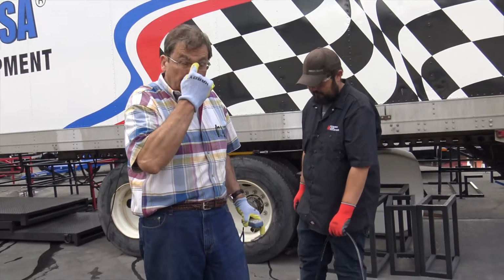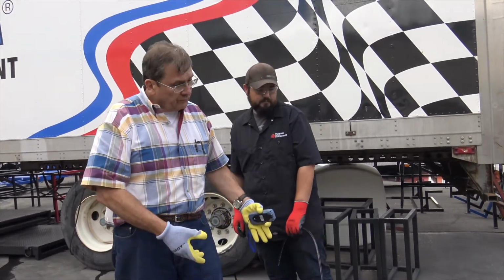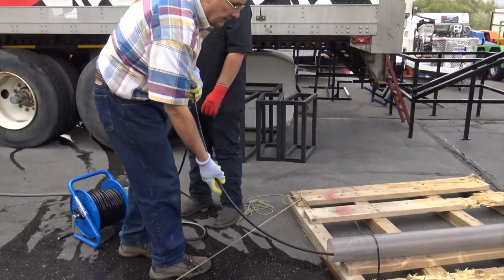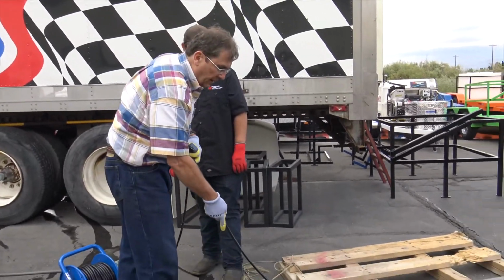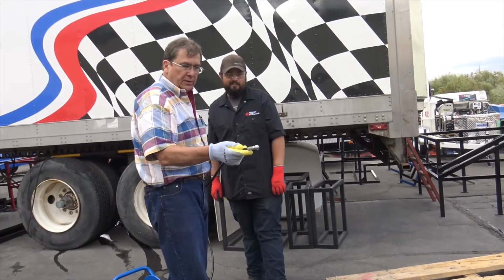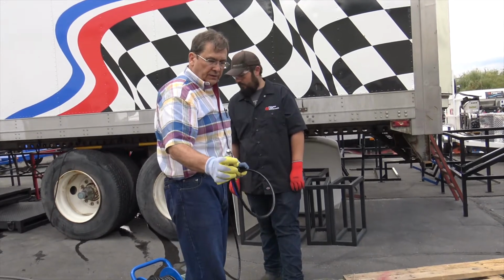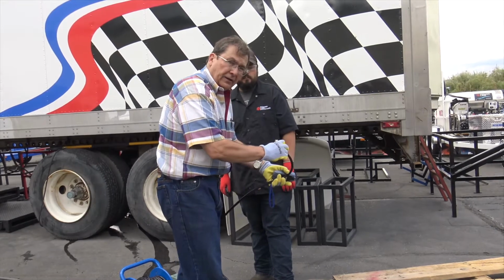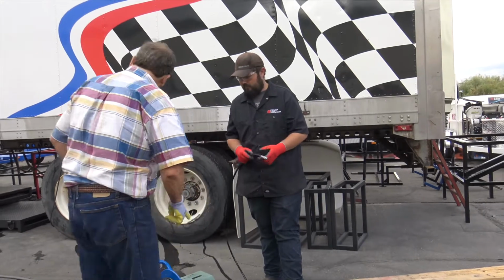Now if you have any problems with this hose or uncomfortable, don't use it. Just saying it flat out. Buy a little electric jetter from us with a hose bib and you can do your inside drains. A lot of guys really love this once you get used to it. Again, if you're unfamiliar or uncomfortable with this type application, don't use it. Make sure, if you're cleaning too big of a line, now that's a small hose diameter, but you don't want to have that hose go up in a clean out if they've installed it wrong and have it come back at you, right?